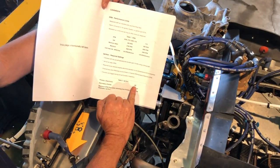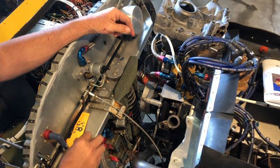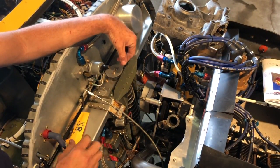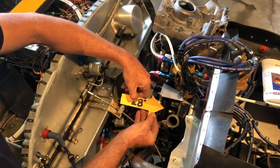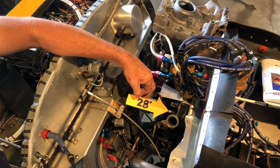How do we see 28 degrees on the engine? We have a handy reference point. As we look at the rear of the engine with the distributor removed just for clarity purposes, the timing mark on the balancer will come up to line up with the center line of that bolt right there. That is 28 degrees.